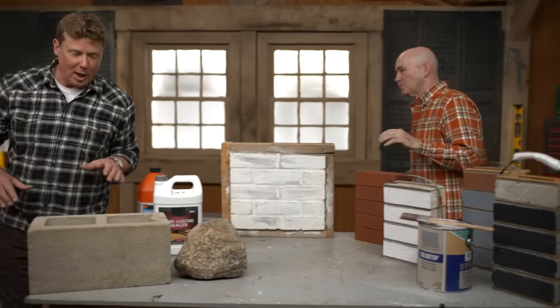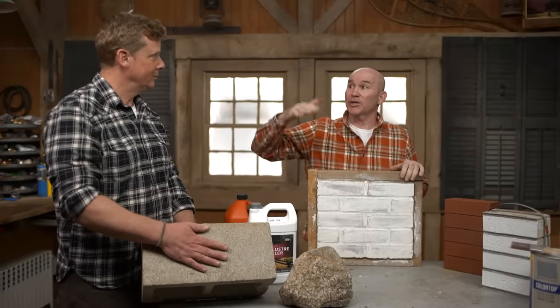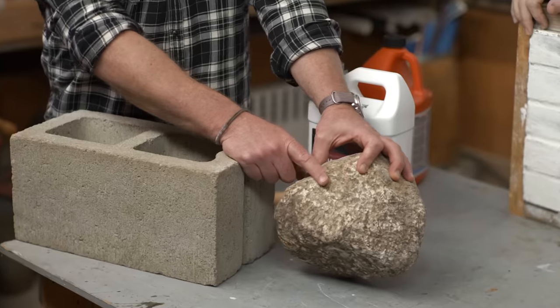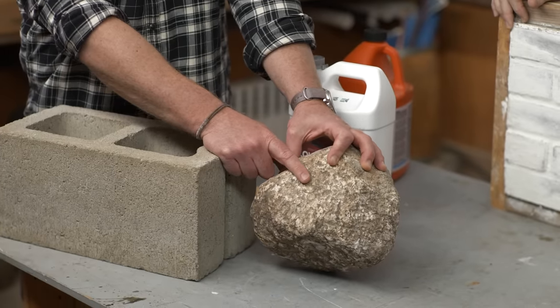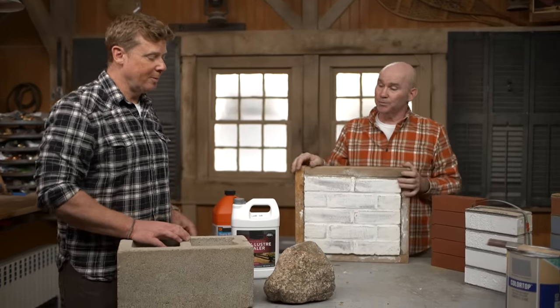If I wanted to give a color to exterior block, I can do it outside as well? As well — it's a perfect product for that application because foundations take a lot of beating over the years. Once you apply this, instead of having a gray foundation, you can match the body of your house or the trim — it's a seamless look. Could I seal a rubble stone or granite foundation? If you have a stone foundation, we still encourage you to seal, because you have masonry joints around the stone. The sealer won't really penetrate that stone — it'll act as a shield for a few years and then wash off — but it's going to sink into that mortar, get activated, and repel water. So it's mostly about the mortar. Yeah.